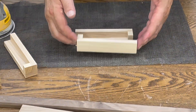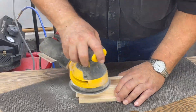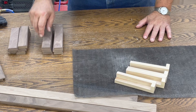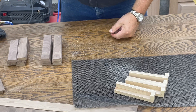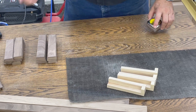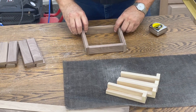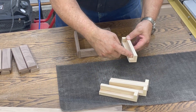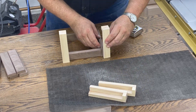We have our side pieces all cut to size and we need to sand the inside edge before we assemble. We've cut our little walnut strips for this size pot right here. Our pot is six inches round, so we've cut some six-inch sides and some seven-inch sides — the seven allowing for the two half-inch thicknesses on either end. We're going to nail this together in a little square and stack three levels of this together, then stack those levels inside our corners.